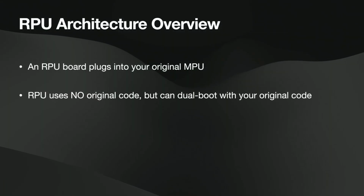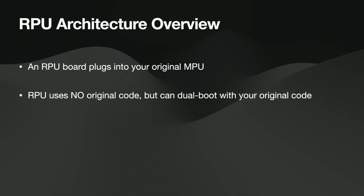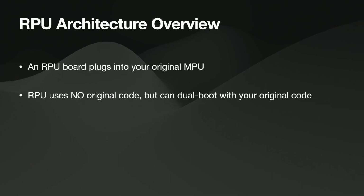So these boards use no original code. There's nothing in here that's stealing anything from, let's not get into IP, but there's nothing in here that has any IP back to the original machines. This is all new. So I created a library from scratch, using oscilloscopes on the MPU to figure out the timing of the solenoid, something John was just mentioning a minute ago, where you have the flyback. I learned at the time that you have to turn off your solenoids for Bally Sterns right at the zero crossing. So I replicated all that in the Arduino, using some of the same theories that Bally published in the Theory of Pinball document that they did when they came out with the original solid-state machines, but all new implementation.